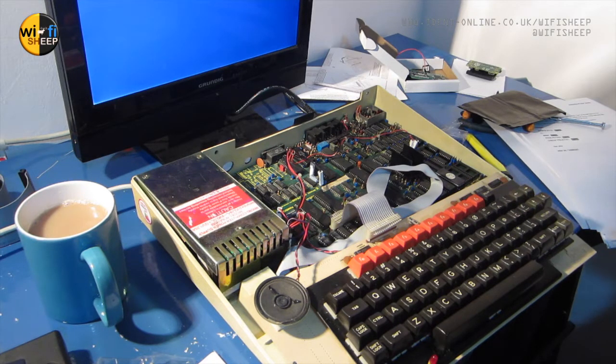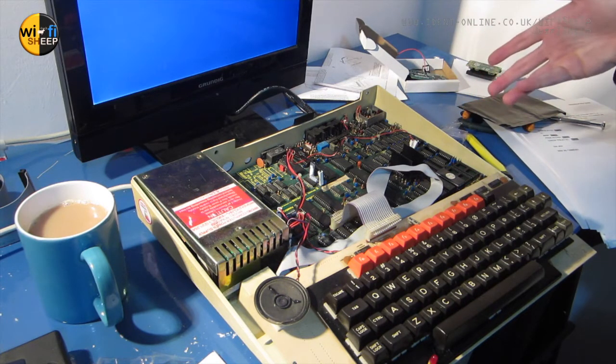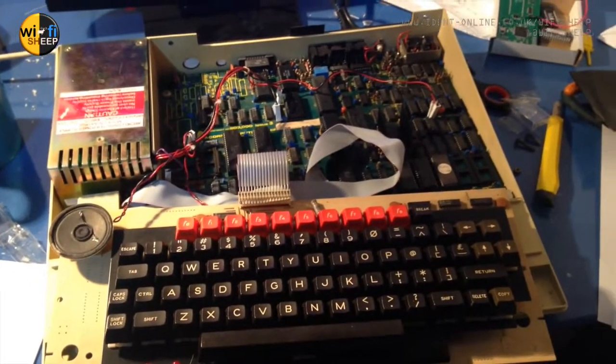It was having none of it — just kept throwing funny errors or odd screen modes and wouldn't do it. I managed to work around that to make the video, but I've got to come clean: it didn't fully work. I don't think it's the software or the board — I have a sneaking suspicion it's a RAM fault with the Model B itself. The RAM chips are here; you've got 16K soldered and 16K socketed, upper and lower bank RAM. It could just be one of those chips is faulty — and this machine is now about 35 years old, probably manufactured around 1982.